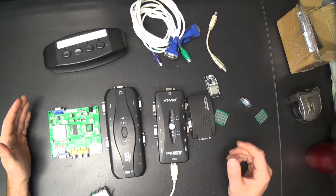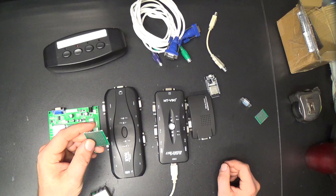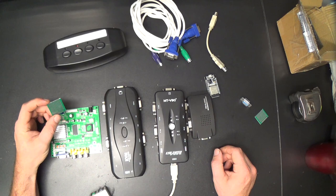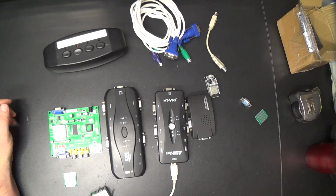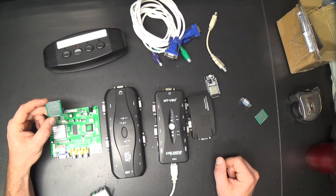And that leaves TTL RGB. And let's see here. That's what one of the pieces of protoboard is a stand-in for, to remind me about that. It's possible to build a little circuit to convert TTL RGB to analog RGB. It's not as simple as just making a resistor bridge. I mean, you can do it that way, but the brown color doesn't look great. You have to use a little bit of additional logic in there, and probably a video amplifier transistor.